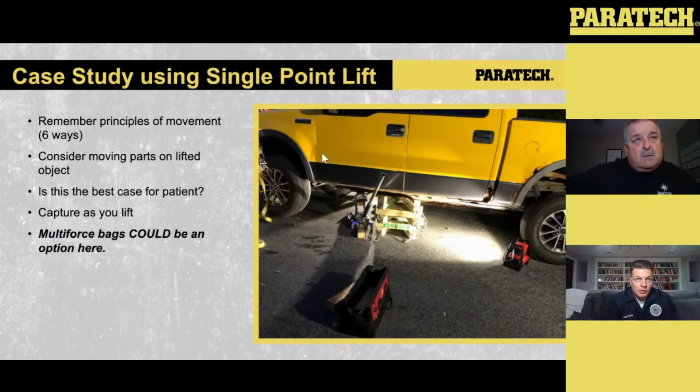What rescuers, myself included, I was fortunate enough to take a level 1 and 2 rigging class to understand dynamics, lifting and slings and center of gravity. But in the heat of the moment, it's hard to figure all that out. When a skyscraper is being built and they're moving an object from here to there, these guys are sitting down, calculating everything out. They know exactly where the center of gravity is, they've made sure their angles for the sling can take that force, and everything should be as perfect as possible, because it's not life or death in that case.